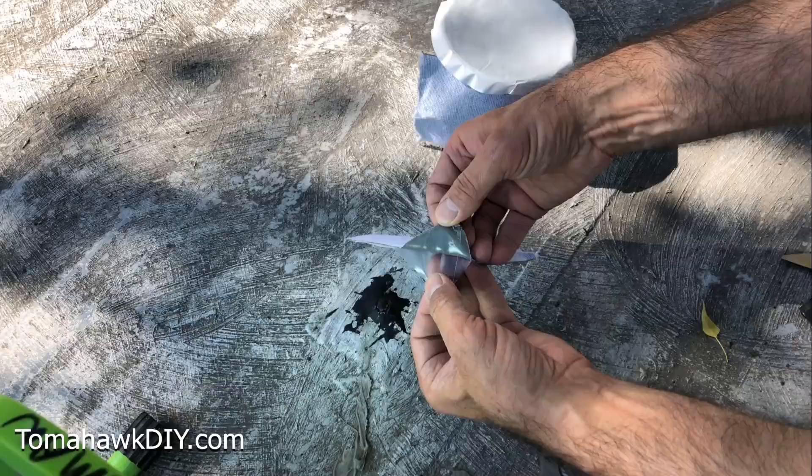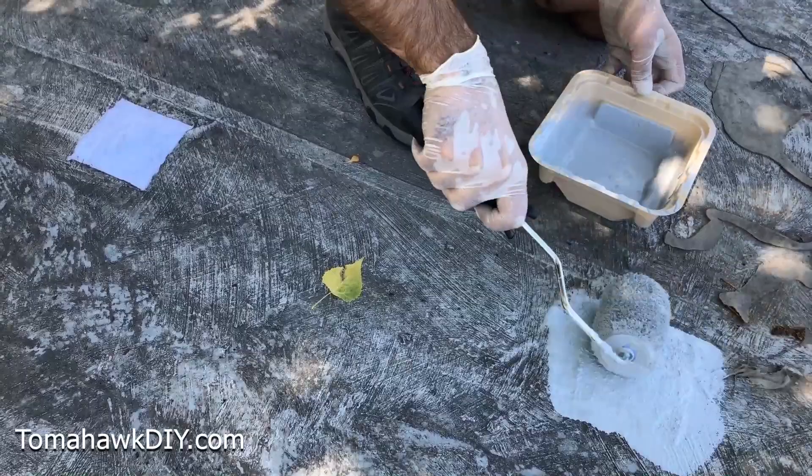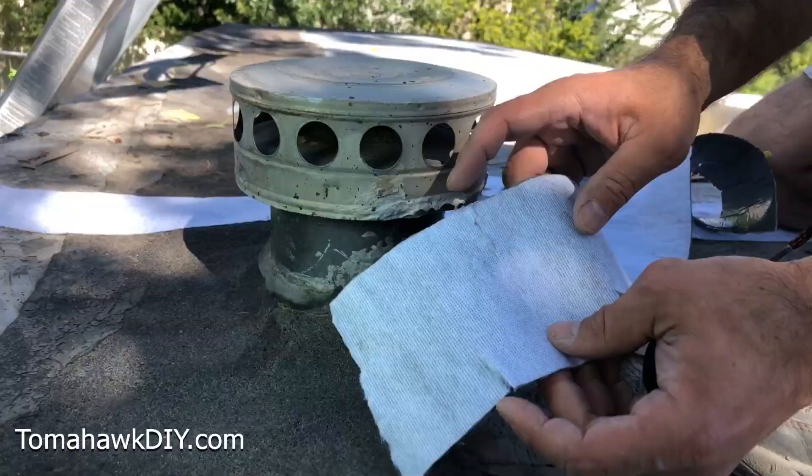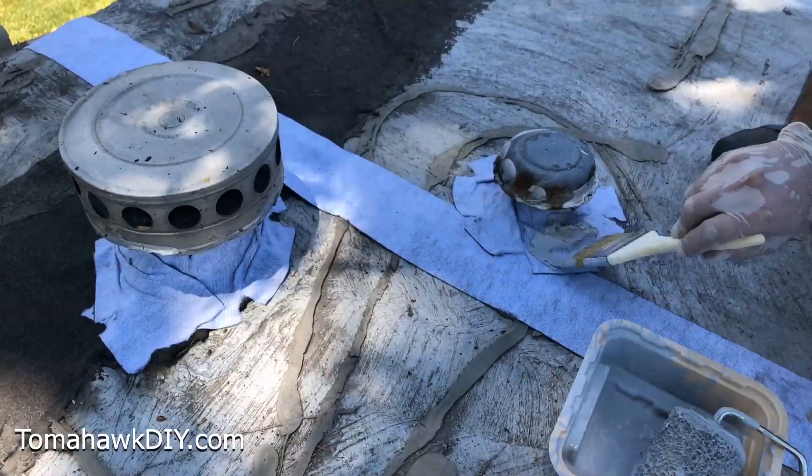Let's look at how the RubberFlex waterproof tape gets applied over a screw hole. We're going over those screw holes, coming out past the edges of our waterproof tape. I've cut alternating relief lines along the length of the tape — that should help us wrap this. Now we're going to apply some pressure. I'm going to use this three-inch brush to help apply it.